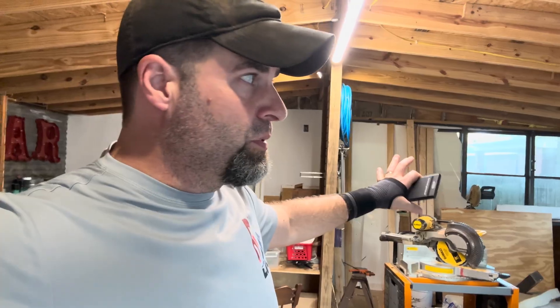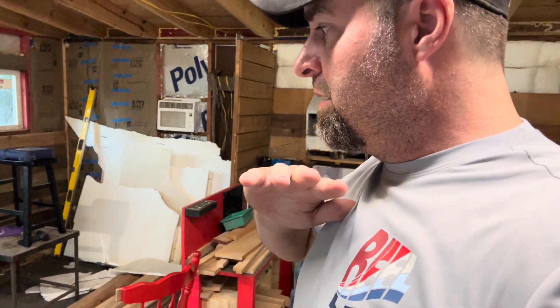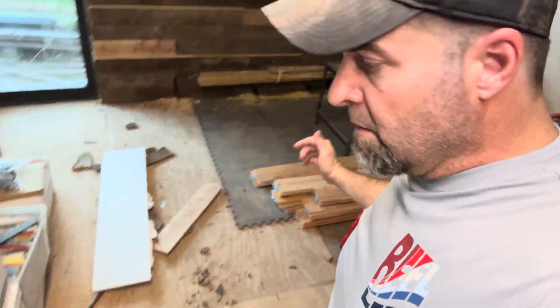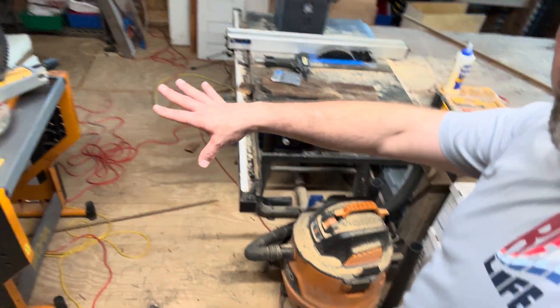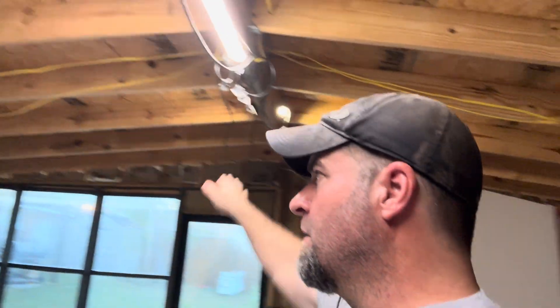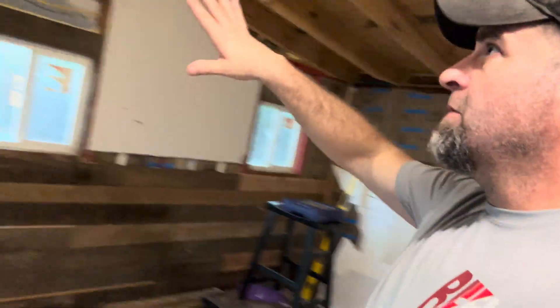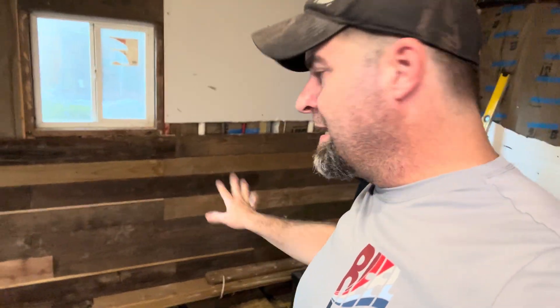We are still in the middle of finishing and renovating our 620 square foot workshop. You can see we've got insulation in pretty much all the walls, but we still haven't insulated the ceiling. We rebuilt the whole thing this last February — we literally leveled the entire floor, redid the joist system, rebuilt the walls, redid the entire ceiling. We've got a massive beam that comes through here. It's metal roofing on top with synthetic underlayment, the whole thing is airtight, sealed, and insulated.